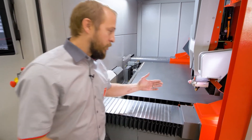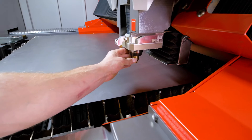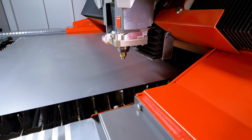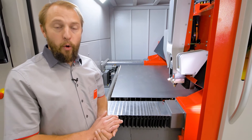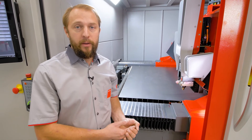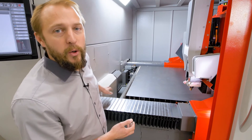But in case we still have a collision, we have here on the bottom our nozzle body — this can be moved. So if we have a collision, the machine will straight away realize it and redo an automatic centering. Or in case we have an NCT tool, we will do a full automatic centering and restart to cut on the next part. So we are not stopping our cutting process, which is quite important.